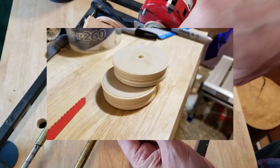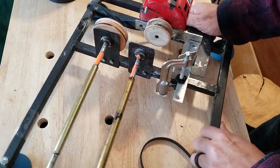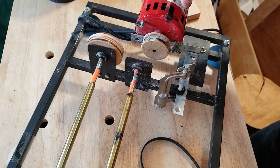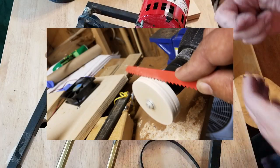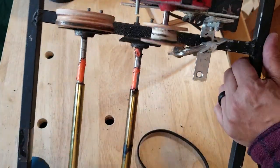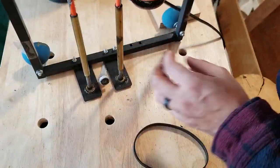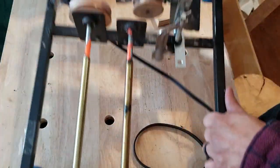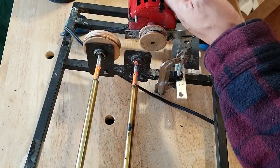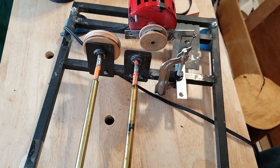I used a drill with a hole saw to create the blank. In the middle of the hole poked by the drill, I just tapped it with a screw and stuck it on a regular battery-powered drill, then dragged an X-Acto knife until I got the shape I wanted. I calculated the ratio between the inner diameter and the size of the next pulley, and you've got a perfect pairing set. This thing runs forever, it's super quiet, and the motor runs nice and quiet too. I'll show you how it all works now.